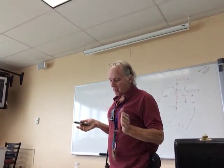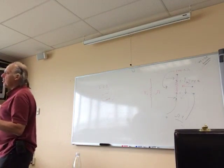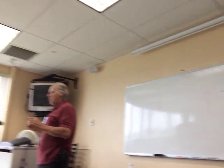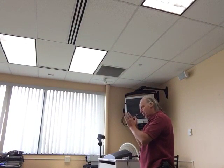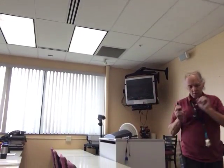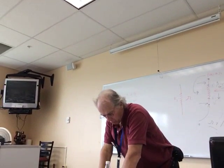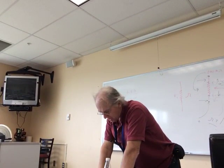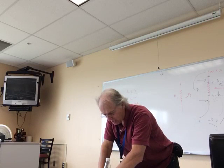What if it was like a million or a 10 million ohm resistor, a 10 meg ohm resistor? Well, now it's bias. Is there a little current? Yeah, a little tiny bit, but it's pretty negligible. So then a voltage divider works really well to bias that circuit. Notice that they do a four-resistor divider in 8-16, and they actually do the calculations and show the current.